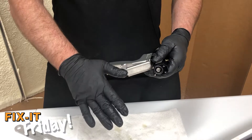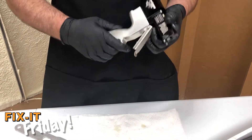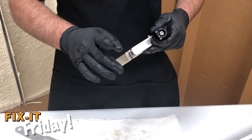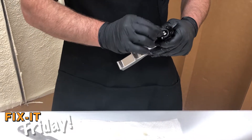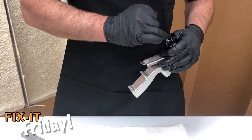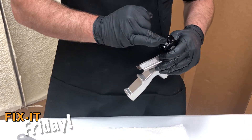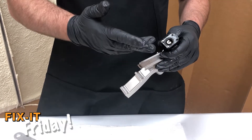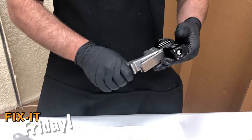At this point, we can rebuild the front of the gun — that's the liquid end. You're not necessarily going to service the air motor in this area as much. However, I do want to point out that we have an O-ring here. From time to time, this O-ring will require replacement, and it gives you an opportunity to see that you're keeping good grease in there. You can pack the grease from this point back — it's just something you'll want to check in between service intervals.